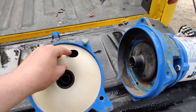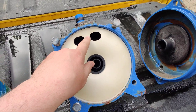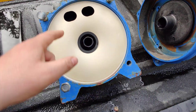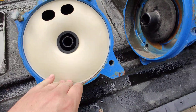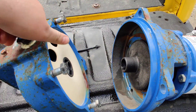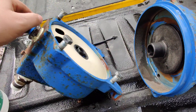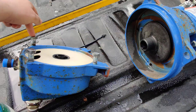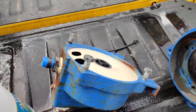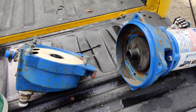The most important part is that the outlet is at your 12 o'clock position — the top of the pump — on a Goulds J5S, otherwise you will have problems. Take the two halves and put them together, put your bolts in, and snug them all up. There's not necessarily a pattern, but tighten in a star pattern and you should be good to go. Hopefully nobody else has to deal with the same silt issues I did.